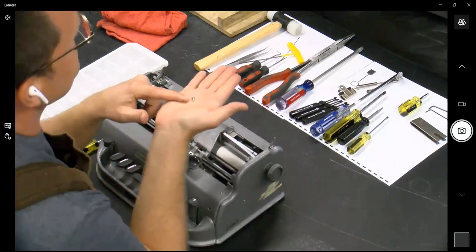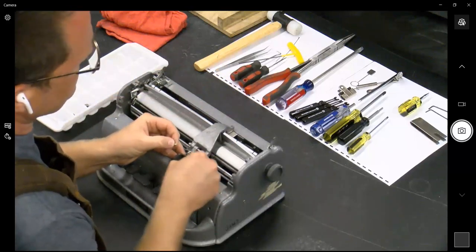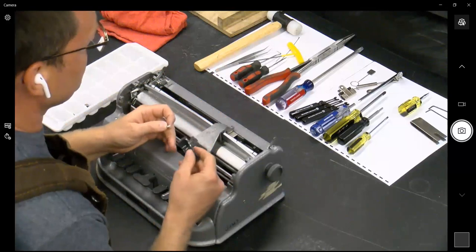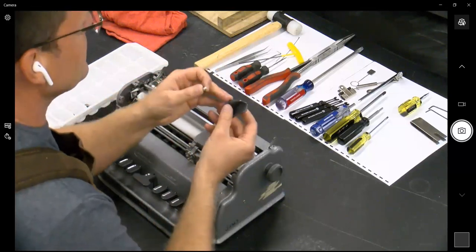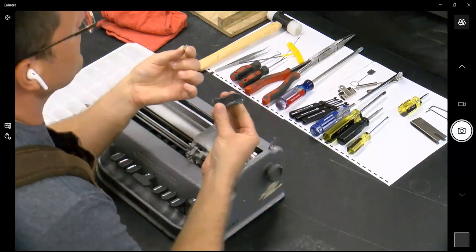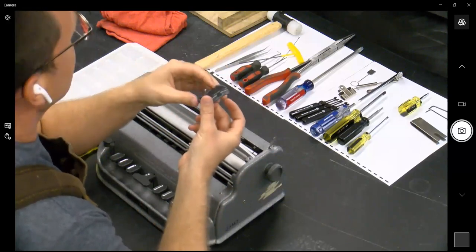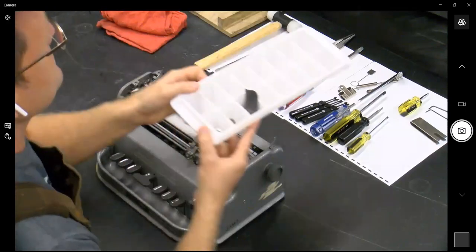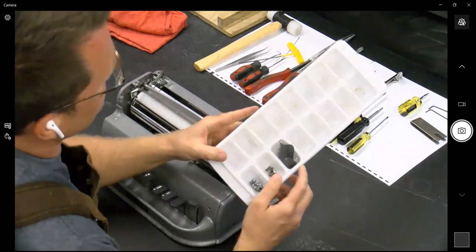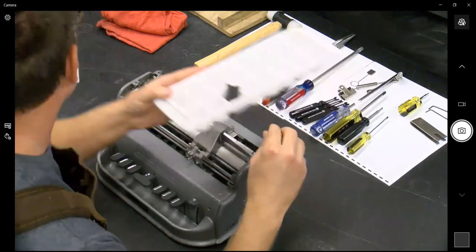The screw has a split washer — hold those two together while you pull the lever out. You might have to wiggle a little to get it out; there may be a lot of grease impacted in there. Because this screw looks very similar to some of the top plate screws toward the back of the brailler, I screw it back into the lever a couple of turns to keep it in place, then put it in my tray. So right now we're tracking: bottom screws, top plate screws, and a separate compartment for the lever and paper guide.